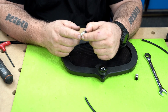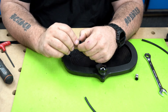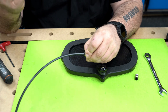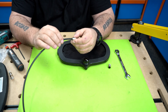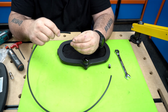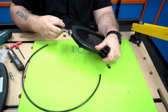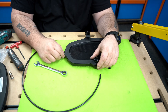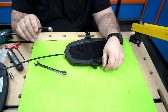This is a quarter-inch NPT thread, just like the threading on a traditional air fitting. On the other side we have a quarter-inch push-connect fitting, so your airline just gets pushed in and that's all you have to do — you're connected and it's airtight. If you want to remove the airline from the push fitting, just give a little gentle pressure forward on the airline and then pull down on the connection and it pops right out. Now let's install this on the front of the back plate, and to tighten that down you'll use your 9/16 wrench. You don't need to over-tighten it — just snug and flush up against the plastic. We did include a second push-connection fitting so you can start attaching it to things right away.